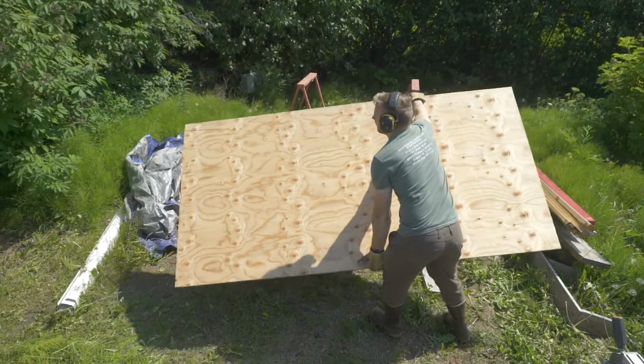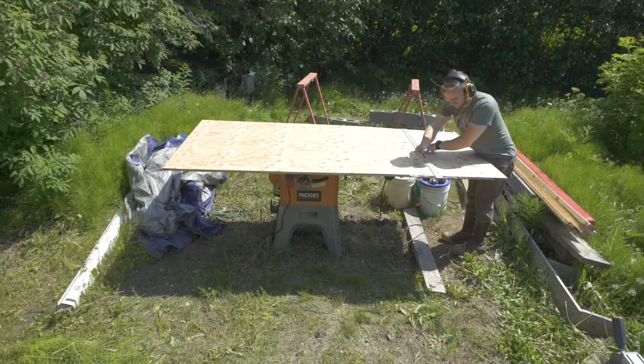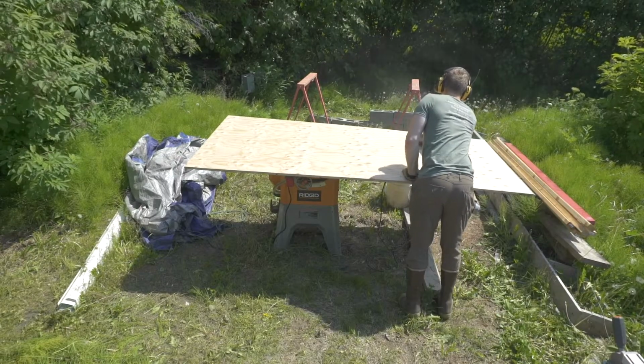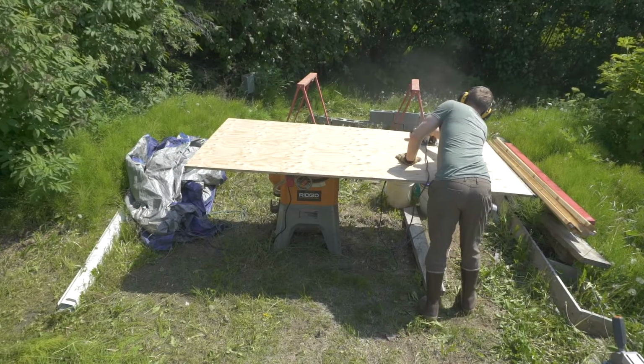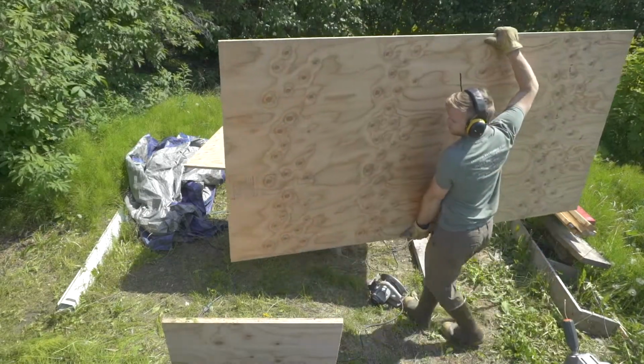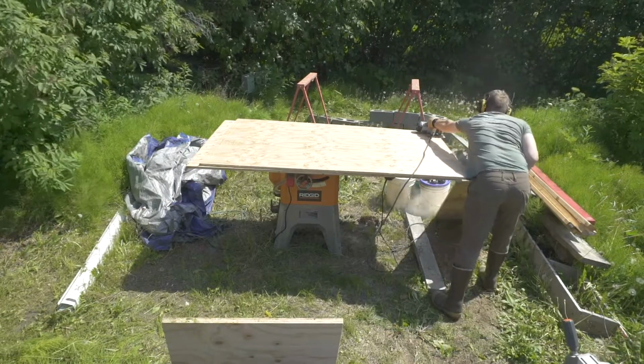So I'm going to start here by ripping the plywood for the base of the bed, which is what will hold the mattress. And I'm using 3/4 inch CDX plywood, which of course is actually 23/32. A sheet of plywood isn't wide enough to make the bottom of the frame out of a single piece, so I'm going to rip 2 pieces and put them together.